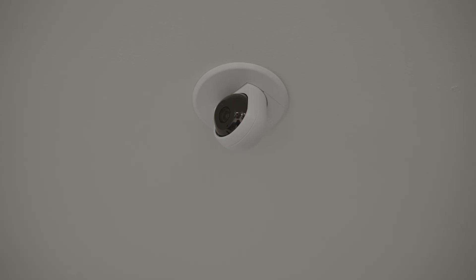First, let's talk about indoor cameras. Inside, we're pretty much always doing flex cameras, especially for spaces like classrooms and hallways. There are exceptions — in the gymnasium, we ended up putting in 4Ks because it's such a large space. We can either put more cameras in or fewer cameras that are higher resolution. One of the myths about security cameras is that resolution really isn't just for quality — we use resolution to get coverage, because the more resolution we have, the fewer cameras we need to adequately cover a space.